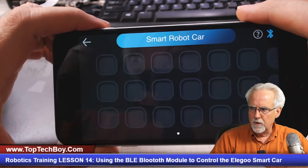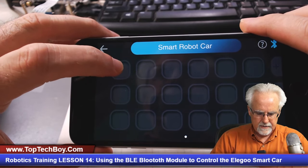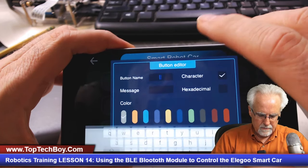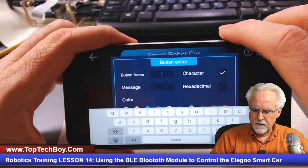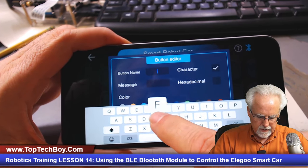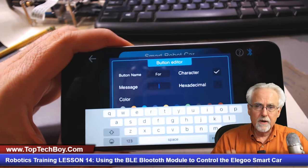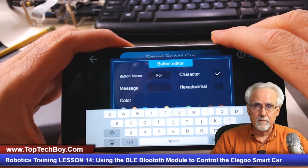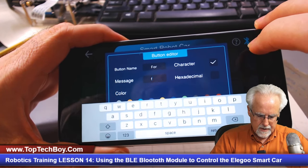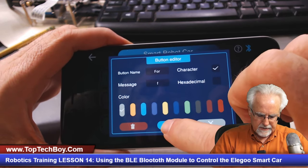is we're going to try to program this thing to send signals to the smart car. And the way you do that is you hold a button down, okay, and then you come over here, and what am I going to call this button? I'm going to call it four for forward. So I'm going to go F-O-R. That's going to be my forward button. And what command do I want to send if someone presses the forward button? I'm going to command an F, okay? I'm going to send an F, and it's going to be a character, all right? And so that is good.